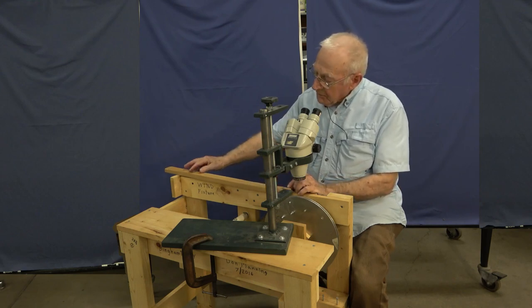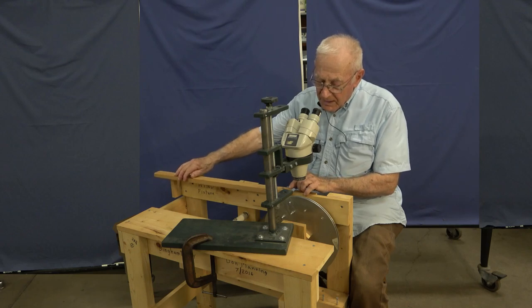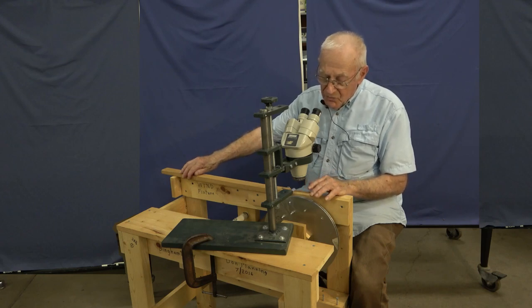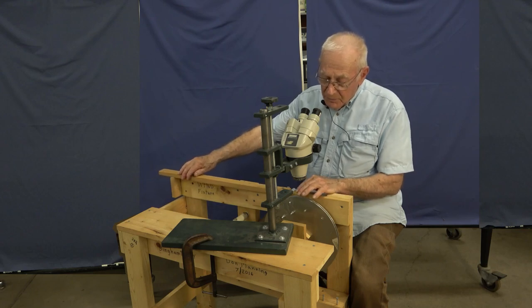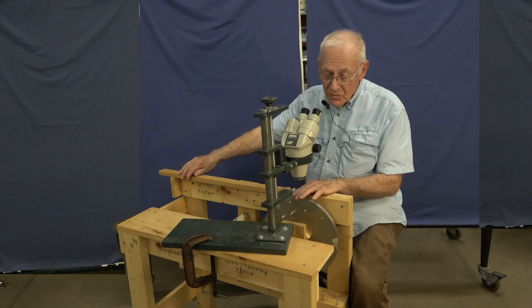And then by the pivot here, we can guide the wire as we wind it, laying it down right next to the previous wire, until you've got all the wires all the way across, essentially a quarter of an inch wide. It depends whether you're using 3/1000 wire, which they originally used, and this one I put together with 4/1000 wire due to availability. So there are a few fewer windings with the 4/1000 wire than with the original 3/1000 diameter wire.